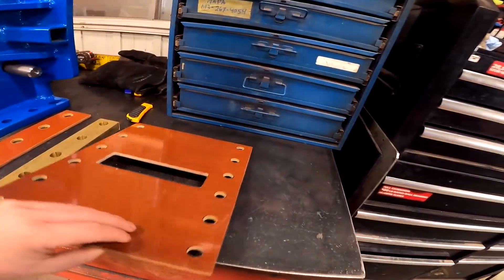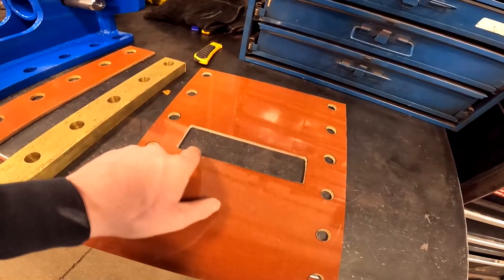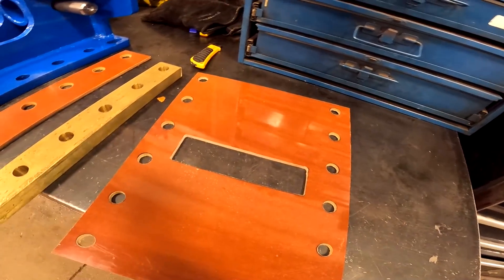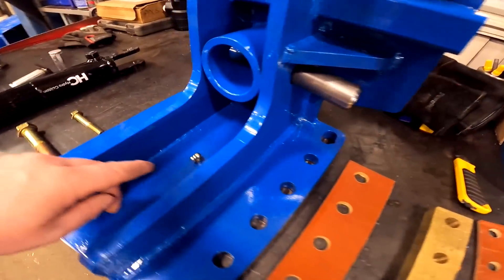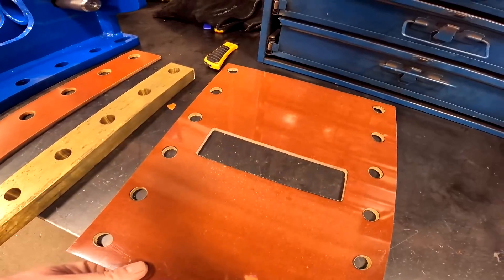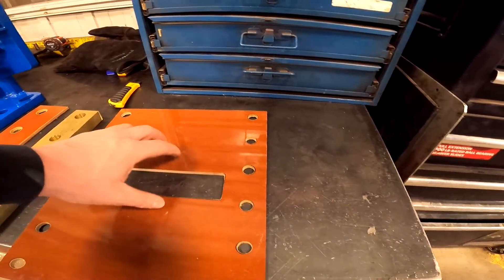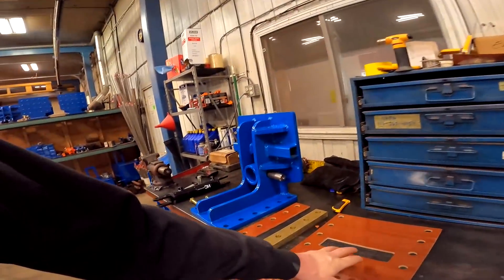This phenolic is actually a wood product — it's what they make computer boards out of. You can see there's a hole in the middle of it, and as you pump grease into your pusher it fills up this slot. As the pusher moves back and forth, it distributes grease down on the beam and keeps it lubricated. Over time this phenolic will actually become saturated with grease. What I normally tell guys is: when you first get one of these machines, pour the grease to it — use grease or bar oil on the beam, whatever you have — just make sure you get lubrication into this.